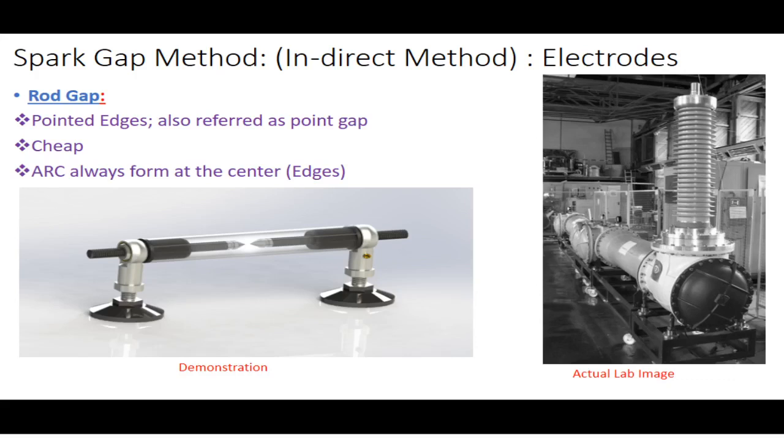So that's why this is a fully enclosed and sealed, controlled environment where you are going to measure the high voltage. But this is the more sophisticated type of rod sphere gap instrument. In our lab we have a simple, low cost instrument for just understanding the typical, not too high voltage, like up to 100 kilovolts. The apparatus shown is used for up to 1000 kilovolts.